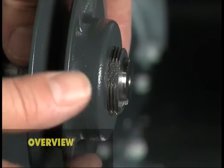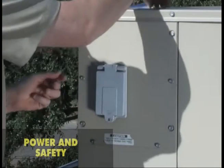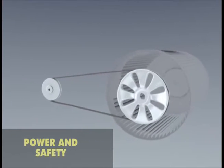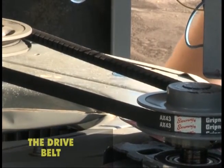On some motors, the pulley is adjustable, allowing for blower speed changes. Before opening the unit access panel, turn off the main power. Use extra caution when servicing equipment that has sharp rotating blades, open pulley wheels, and a fast-moving belt that can suddenly pull hands, tools, or clothing into them.